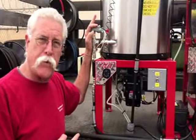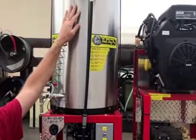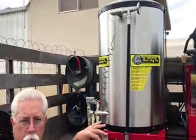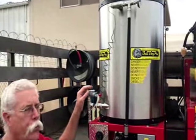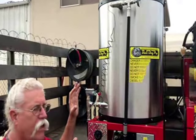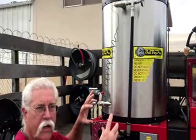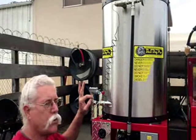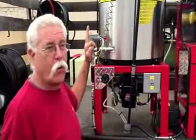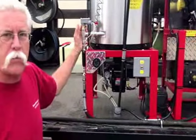We even have a redundant temperature control on the inlet of the heater — no one else uses these. Of course, you've got a high-temperature limit adjustable temperature control on your heater for controlling the normal running temperature of the system. But we put an inlet temperature limit set for 140 degrees so that if there's no water flowing and the fire in the bottom half of the heater is heating up this piece of pipe right here, when it gets to 140 degrees it just shuts the heater off. It can't explode. It won't have the problems that all the other heaters on the market have.